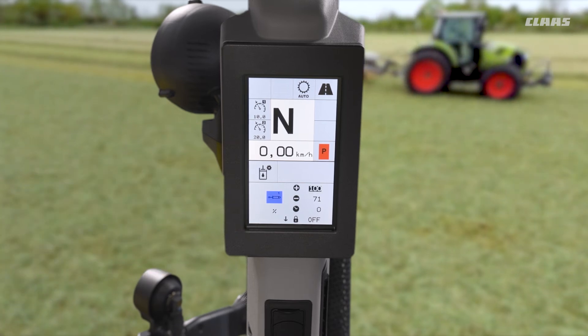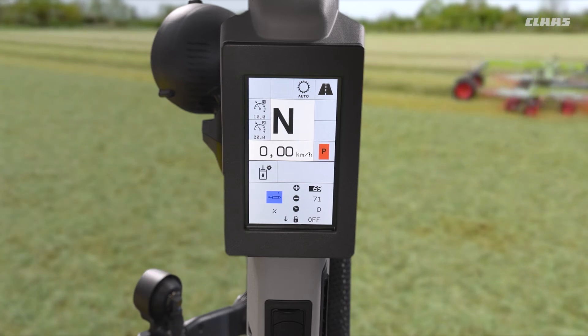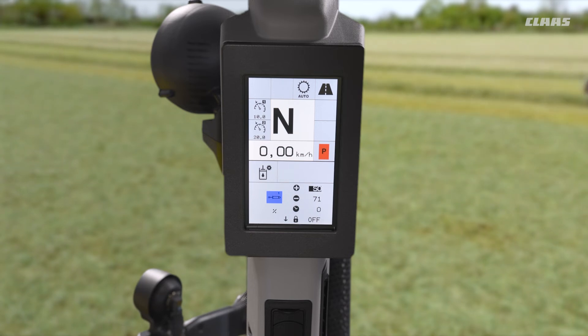For example, I can set my valve to 50% flow in the positive direction, the same on the negative side, and then set a timer to that valve of maybe 12 seconds. What would happen is that as I pump the valve in either the positive or negative direction, it would continue to pump for 12 seconds and then turn off automatically.